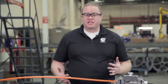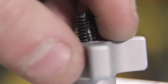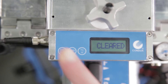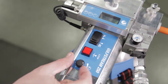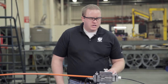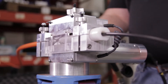Before we do any actual installation, I need to recall my push force and clamp force down pressure settings that we had established in our crash test. I zero out the count so that we get an accurate reading. Now we want to make sure our speed is all the way down, then engage our drive forward and slowly increase our speed up to maximum. We're doing push only — I haven't added any air yet, so we're just operating the motor of the Gulfstream 250.